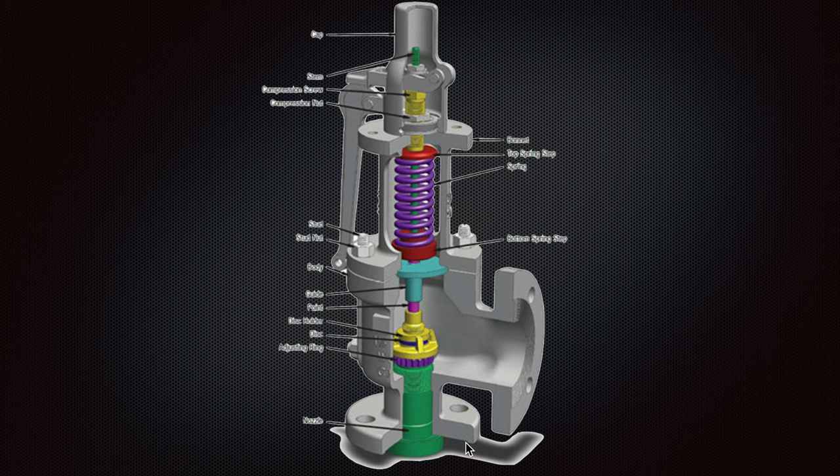In front of you, you have the relief valve — the safety valve — which is used just to protect the boiler from overpressure and avoid all the internal parts being overstressed. The boiler reaches its maximum pressures, so one of the crucial parts and most important things is the internal pressure and temperature. We try as much as possible to avoid our boiler tubes being overheated, otherwise we will damage and stress the boiler structure.